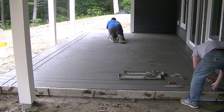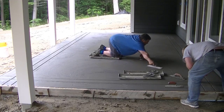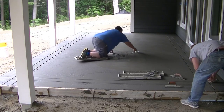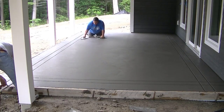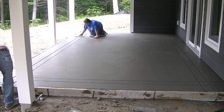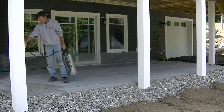The homeowner also wanted a nice smooth steel trowel finish. We put a dark gray color in the concrete — when that dries, it dries kind of mottled, almost looks like the concrete's been stained after you get done sealing it. They just wanted a smooth finish, something easy to clean that's going to look like stained concrete. So we hand troweled it three different times — first pass, let it dry a bit, second pass, then a third pass.